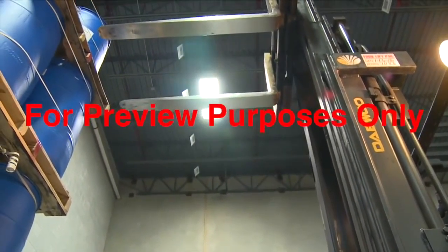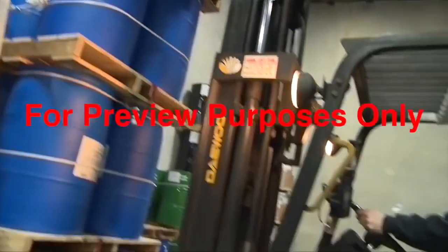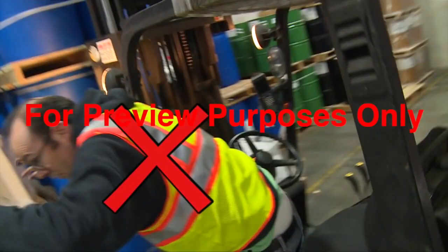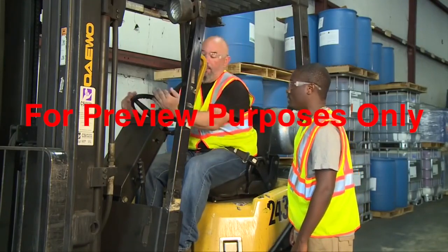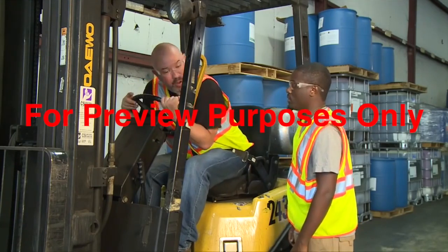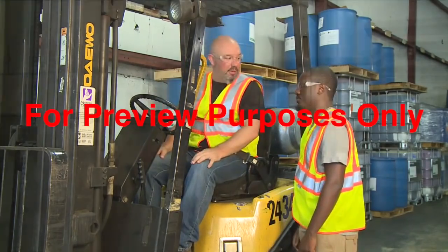Accidents can happen, even to careful operators, so you need to know what to do in case your forklift tips over. Remember, do not try to jump out of the forklift. Studies show that will probably get you killed. Instead, brace your feet. Grab onto the steering wheel and pull yourself tight up against it. Lean in the opposite direction from the way the vehicle is tipping and hang on.